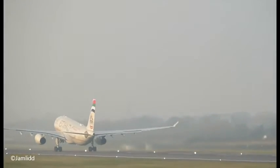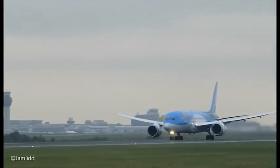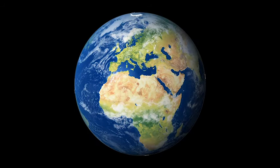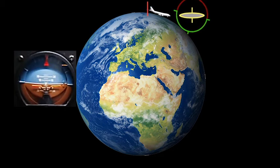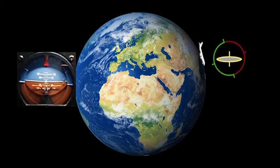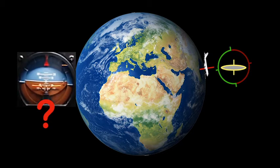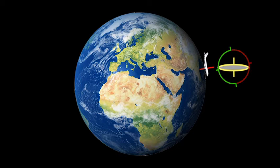Now that we have a fundamental understanding of how the gyroscope and attitude indicator works, let's contemplate an intriguing and quite contradictory scenario — a scenario that occurs every single day during every single flight. When an aircraft takes off, climbs to its final altitude and levels off, the attitude indicator depicts a perfectly level attitude. As the aircraft travels towards its destination, sometimes in excess of 7,000 to 8,000 miles, the attitude indicator maintains a perfectly level attitude. This, as we have seen, cannot be correct, because the gyro maintains its original position in space, regardless of the aircraft's attitude or its position on the Earth.